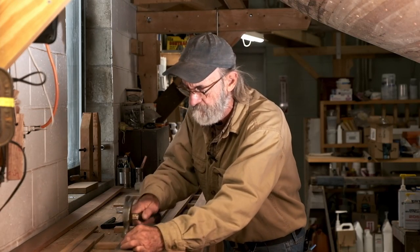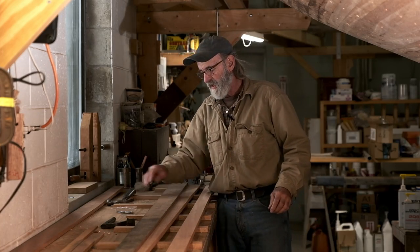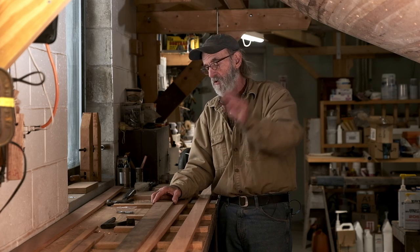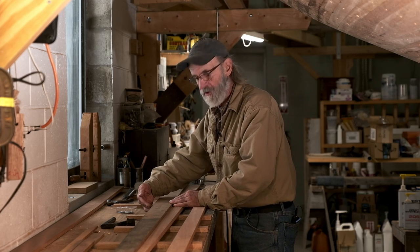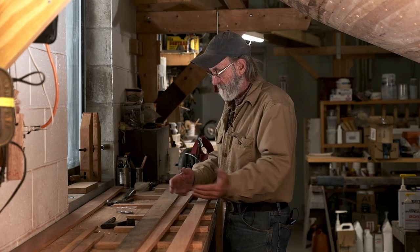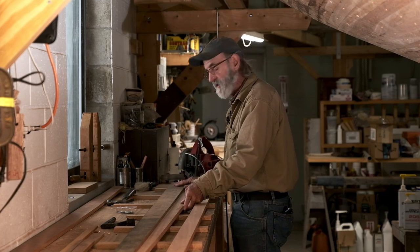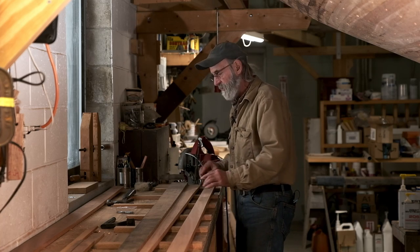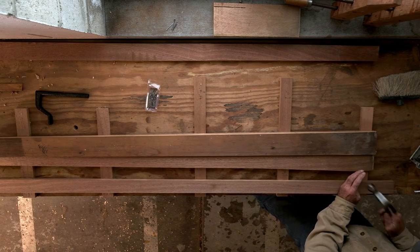The batten is going to be a half an inch narrower than the planks we're going to put on the boat. It's a very simple thing to do — you set your material down on the bench, pick up this batten, put it on there, and even it up on the outboard edge. If you wanted to cut the plank a tiny bit wider to catch up with a line-off line on the boat, or a tiny bit narrower, all you'd have to do is slide this batten over. If you wanted it a little bit wider, you'd pull it this way and have the plank protruding out behind the batten. Very simple to adjust the size of the plank you're cutting.